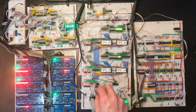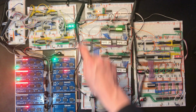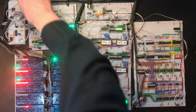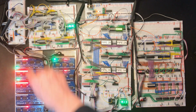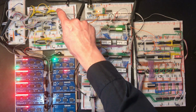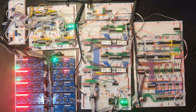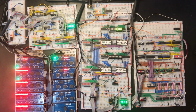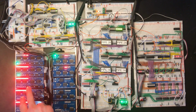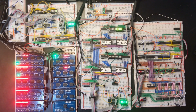So now I'm going to prevent fetch. We're already asserting this one to the bus. Let's tell this one to read, which is the one that we believe works. And then the one at the bottom to read. Yes! So not only have we got the board back into operational state, we have fixed the issue in the new circuit we had where things weren't behaving as expected.